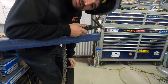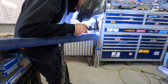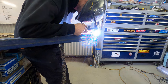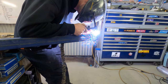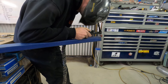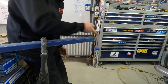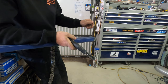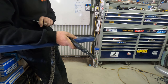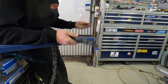As you'll see, there's no trickery over the camera — I'm doing all the welding. One thing to note: the reason I'm welding off the tube onto the end cap is the tube is thinner material than the end cap, so it has a lower melting temperature. What I can do is angle my torch and blow the material from the tube into the end cap, then just add my filler wire as I go.